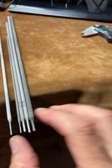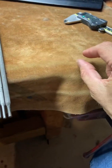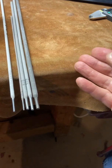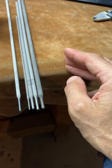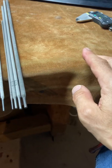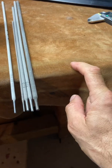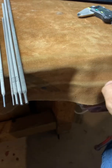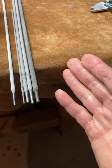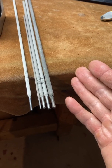So this calculation goes for the welder and the base metal. If you're welding 1/4 inch thick steel, then your thickness is 1/4 inch, 250 thousandths. Therefore, your amperage required is 250. That'll let you know what kind of welder you need. If the job is you've got to weld 1/4 inch steel, you need that amount of amps, though that's a single pass. If you're running a multi-pass weld, of course, you can get away with far fewer. I can weld 1/4 inch steel with my 110 MIG welder, and I think I'm only pumping out 88 amps right there. But I'm not doing 1/4 inch in a single pass. I'm doing it in several passes.